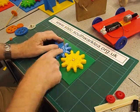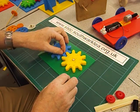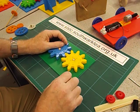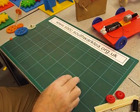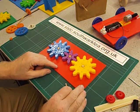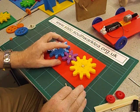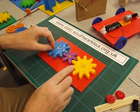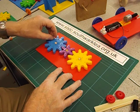Because they're the same size, the drive gear is turning at the same speed as the driven gear — one revolution of the drive gear produces one revolution of the driven gear. If you want to get the same direction out from the driven gear, you can add a third gear in the middle. It doesn't really matter what size it is, but it tends to be smaller to save space — it's called the idler gear. Now when I turn the drive gear, you can see that the driven gear is turning in the same direction, still at the same speed.